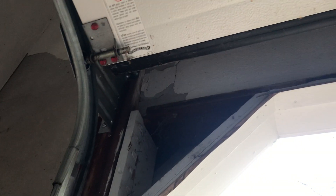This is an overhead door. There's another sticker up there. Here are the torsion springs. And they put grease onto the track, which is unbelievable — do not put grease onto the tracks. We should put grease onto the roller hinges and the bearings of the hinges.